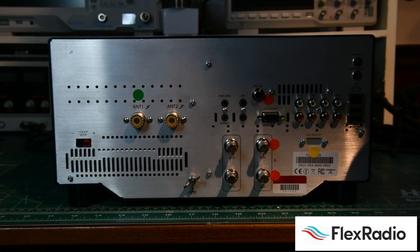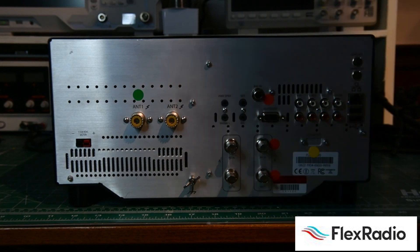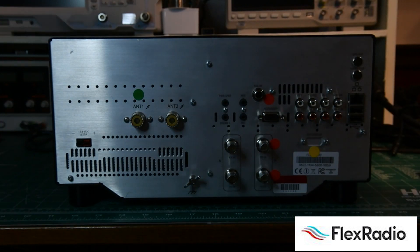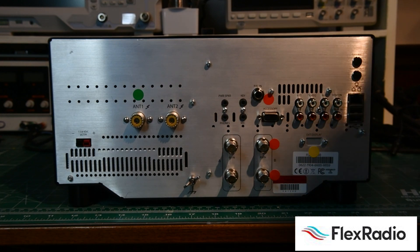The 6400 has two slices, or receivers — full-fledged main receivers. There are bandpass filters in here that are about 35 dB — excellent for field day operation and band isolation. They work really well; we've got many clubs that contest with these.